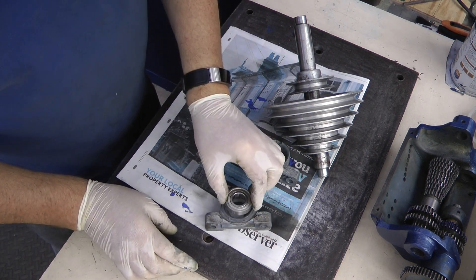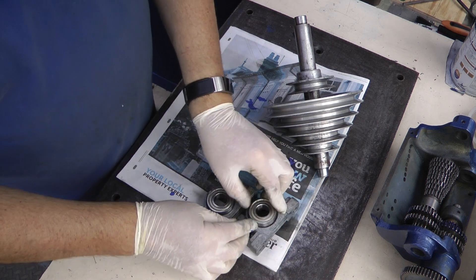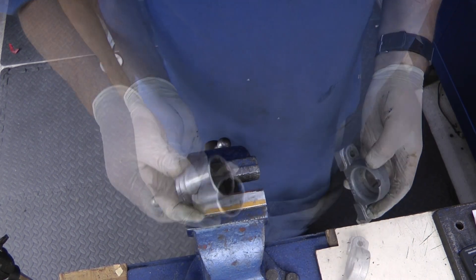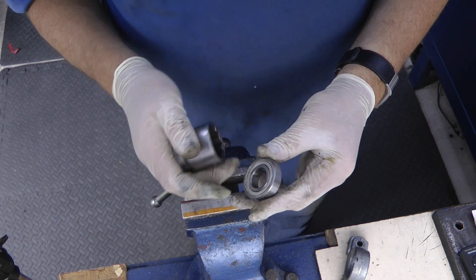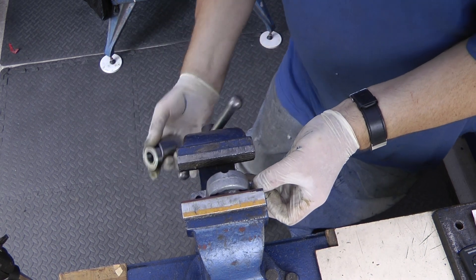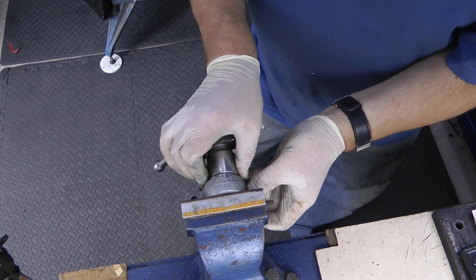What I'm going to do first is press the bearings into the carrier. First thing to do is obtain a socket that fits snugly into the carrier - it happens to be 11/16th Whitworth. It fits neatly onto the outer race of the bearing so we're not going to do any damage. Don't want to push the bearing in by the inner race because it could cause indentations on the race itself. I've got soft jaws on one side of the vise which I'll put the carrier up against, central to the vise to equal the force that's going to go on the bearing.